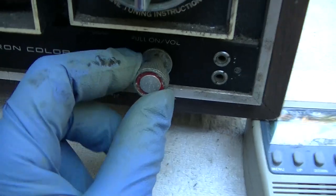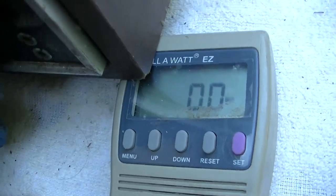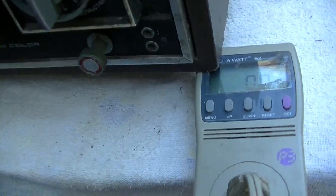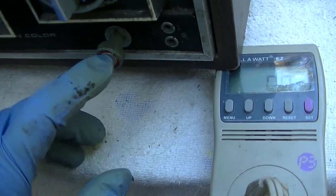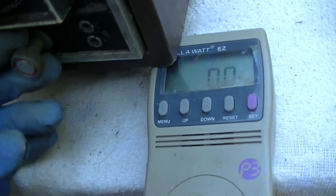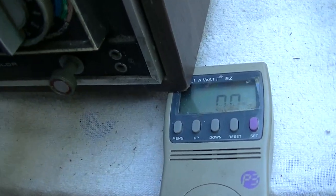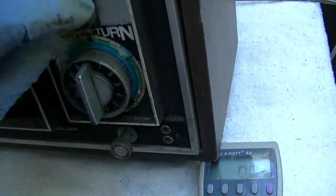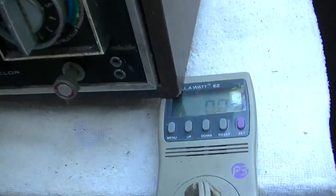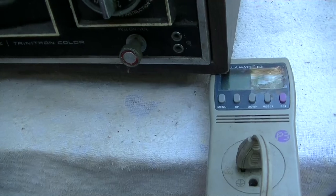And that is the power switch. Now, I believe these have a little tiny electrolytic capacitor that dries out that initiates the start sequence. And if that capacitor is open, this is what you get. Now, do I want to get into this, or do I want to just go dig some new old stock set out of the stash and get into it?